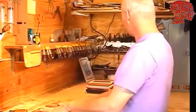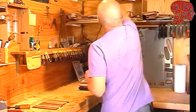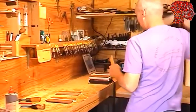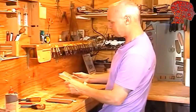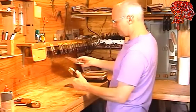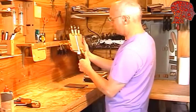So now they're staying where they want to be, but you want to also keep them flat. So I have pieces of plywood. I just have a collection of 1/4-inch plywood, and that gives me a nice solid, flat foundation. And just to make sure that this plywood's going to do its job, we're going to clamp it down to the plywood. I use these little 1-inch spring clamps. And again, I try to clamp every single piece so that nothing can ride up or move up.